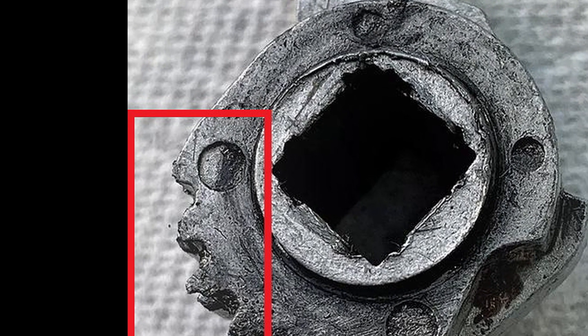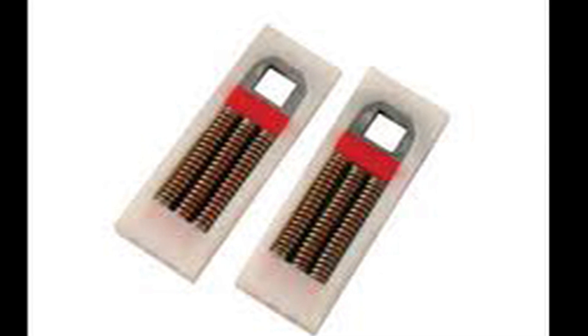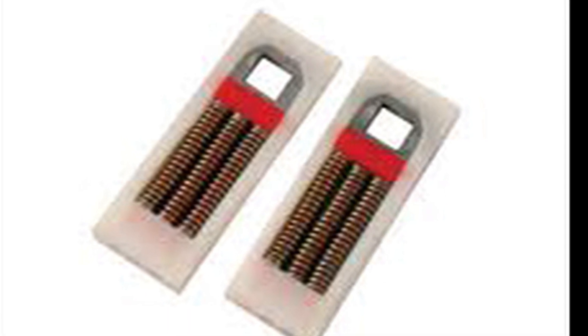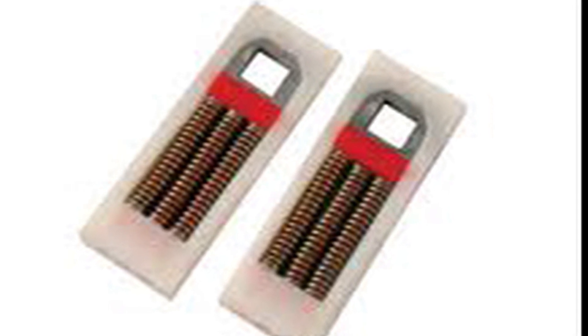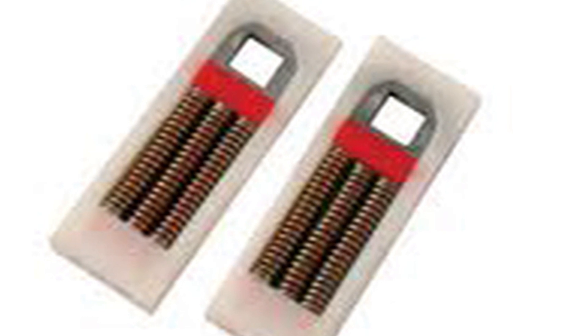You can't just buy new internal parts — they're not for sale and not available. On the internet you might find what's called helper springs, which are okay to help the multi-point lock's return spring. They're not going to be a magical fix. Typically when the spring goes, you're going to have to replace the gearbox or the lock body itself. Once you have the new gearbox inside, your handle lever should be sticking up in a horizontal position. When you lift or push down on the handle, it should return to horizontal — that's its resting position, and you know your lock is good.